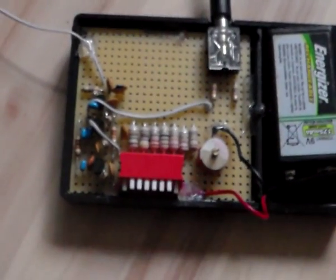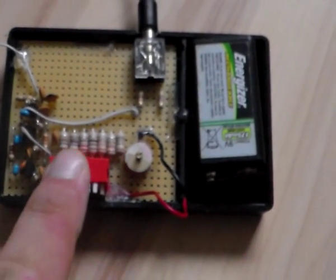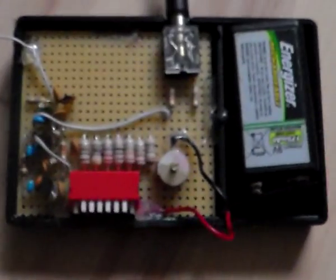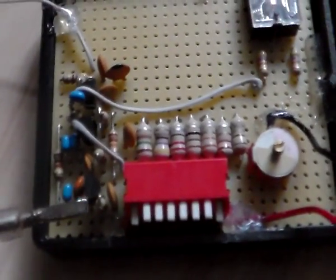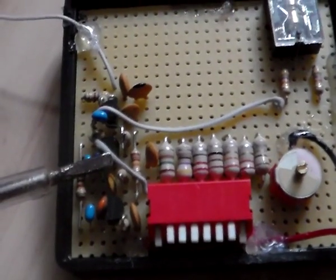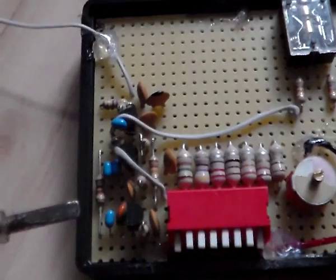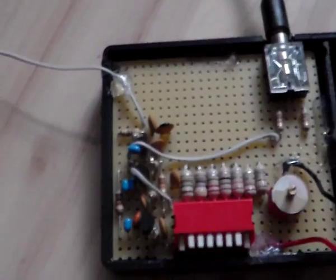If I get close with my hand to the switches, you can see it's a little bit dodgy. This is a pretty straightforward circuit — here's the oscillator, here's the RF amplifier, and here's the AM modulator. All 2N3904 transistors, and this thing produces a neat AM modulation.